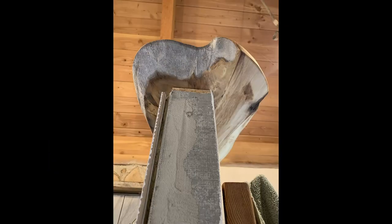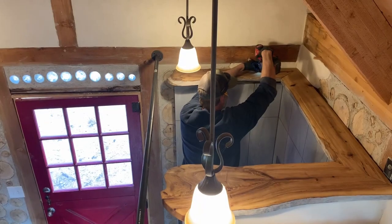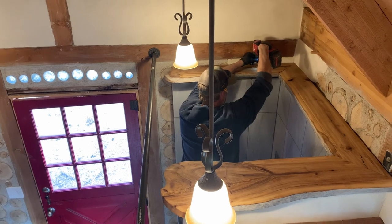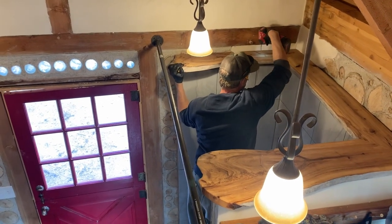I'll wrap these ends in lime plaster and bring it all the way up to the underside of the shelf. I trimmed the inside with some cedar and screwed the shelf directly into the frame wall that the tile is hanging on. I was able to make sure the miters were nice and tight that way.